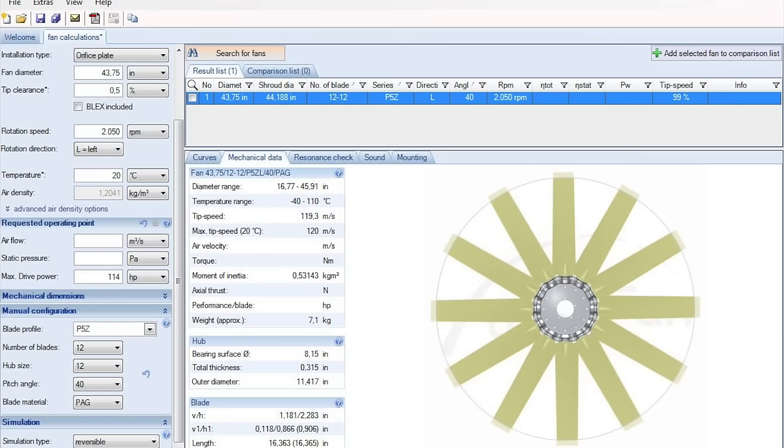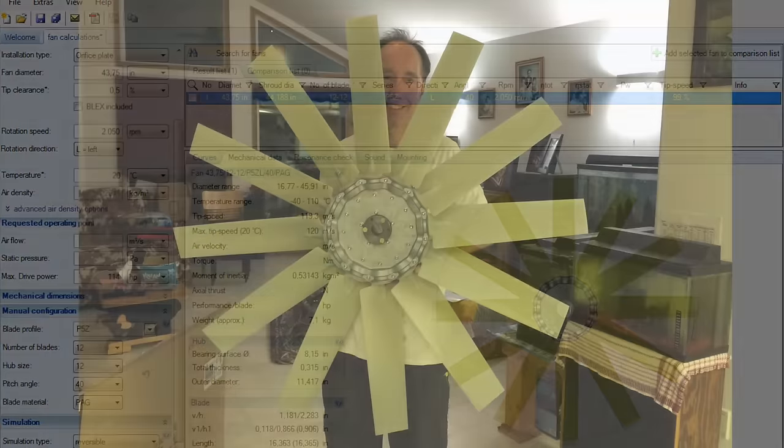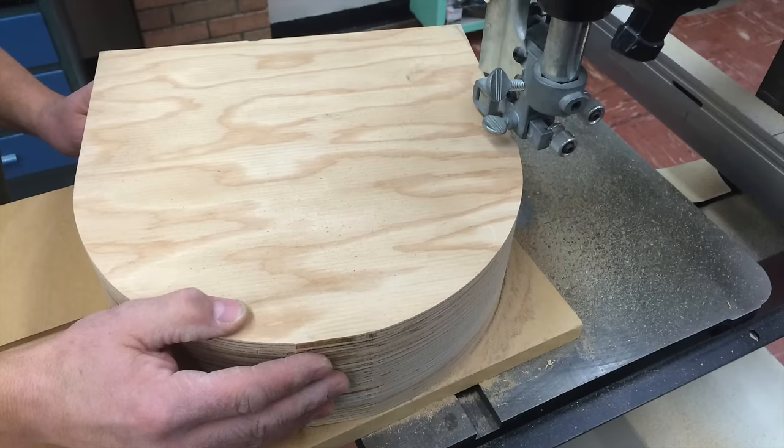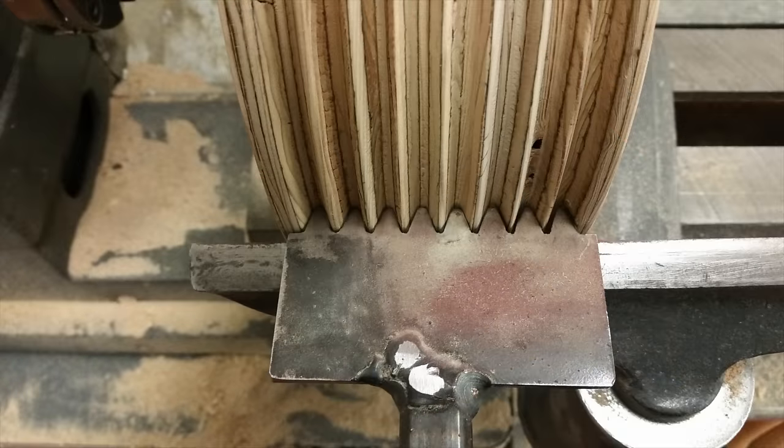I had to order the fan as I needed to get the drivetrain working. I ordered the fan and belt from Universal Hovercraft. I needed a pulley for the belt. I couldn't find a lightweight pulley, so I had to make one out of laminated plywood. I did some research on the belt profile. I then drafted the profile and cut it on my CNC plasma table to make a tool suitable for machining the grooves and the wooden pulley.